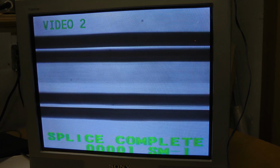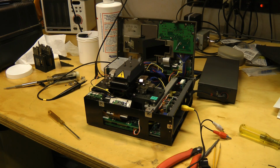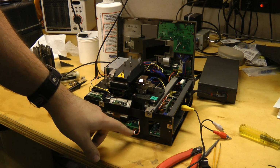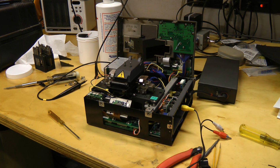Yeah, I'm probably going to put this thing together and put it up on eBay. Certainly not worth scrapping something like this. This is way too good. I guess the reason this thing was crashing when attempting to start the fiber splice was because of invalid data in the configuration memory. Probably because when you unplug this real-time clock, it forgets everything, and when you plug it back in, the RAM is all at random values, and executing that factory reset must have reset them all to the proper values.